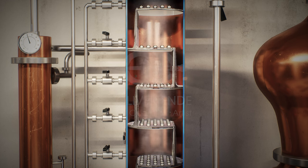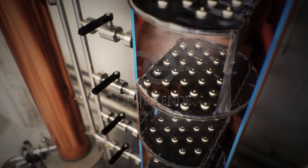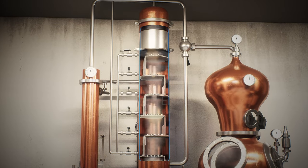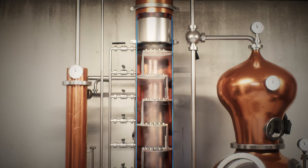This process separates increasingly heavier compounds, such as fusel alcohols, from the lighter compounds, such as ethanol, as the vapor travels up the column. This increases the purity of the spirit. If sufficient column trays are available, distillation in the column can produce a spirit with over 96% ethanol.